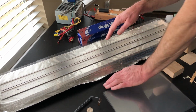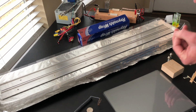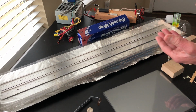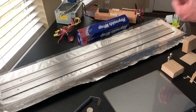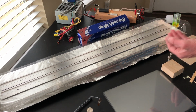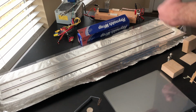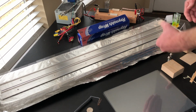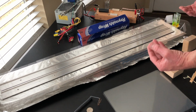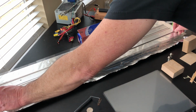Theoretically, a laser like this shouldn't work. It's too long. For an optimal design, 9.5 inches would be, I think, ideal. The reason why is because the pulse is about 800 picoseconds long, and in that length of time, light only travels 9.5 inches. This right here, I think at the expense of efficiency, you're able to get a dirty design that you get more power out of. And you're able to do that because you're going to slightly make one end narrower than the other.